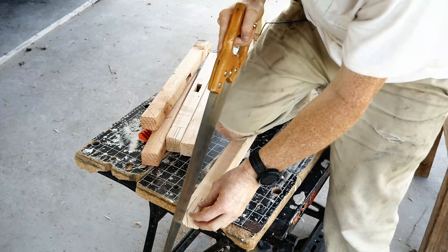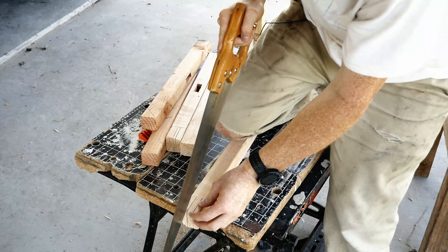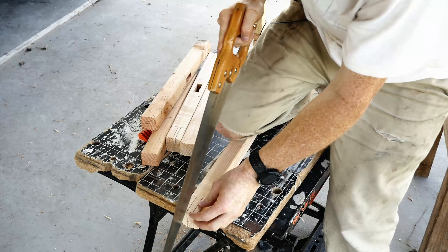The next tenons are these mitre tenons. On each mitre tenon I have three cuts to make: one that defines one side of the tenon and two that define the two cheeks. I do this before I cut the mitre, so I don't need to transfer the line later on. That saves a bit of time and makes it more precise.